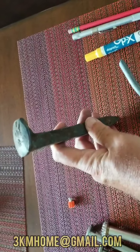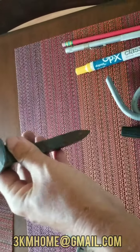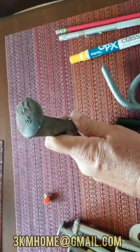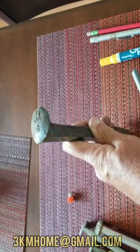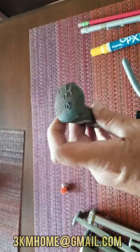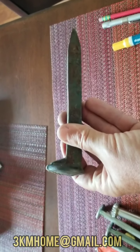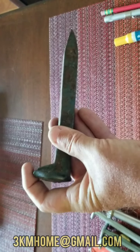We used to use railroad spikes. Once you hammered this in, you could put a punch in there or a chiseled X. When you do older surveys, you'll come across a lot of these. We used railroad spikes for not just monumentation but also for benchmarks — they'd be hammered into a telephone pole with a nice area to put the rod on.